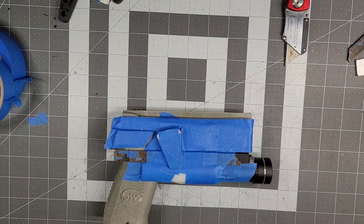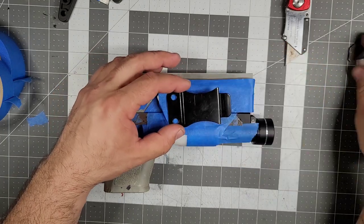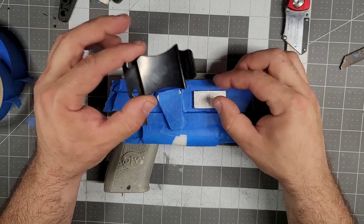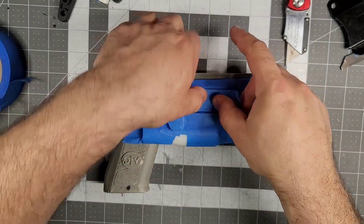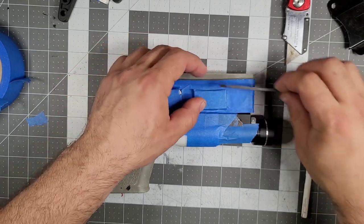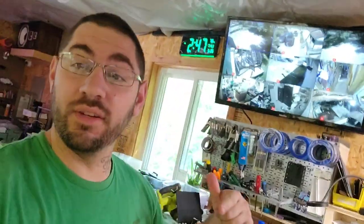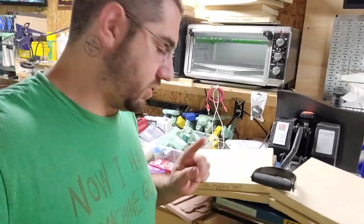Because it's a 1.5 foamy, we're going to grab our 1.5 foamy. I like to put something over here for the clip to be able to grab onto. Next is just the retention plate. Good thing about it finally being summer — it's 70 degrees in the shop, so my foam is not freezing and not rock hard, but I still have it on top of my press. Press is going, I got 70 seconds left. The Battleship Gray is going in there, and as soon as that comes out, we're going to sandwich it between two layers of foam on the bottom and the top because this is a thick boy.